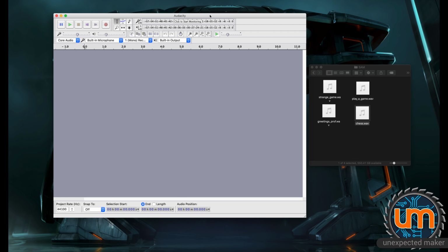It's a wave editing application, and it's cross-platform and it's free. So again, the download link will be in the description below. And here are the SAM files that I've made. So I'm going to convert these over to 8-bit unsigned waves, and that way we can turn them into hex.